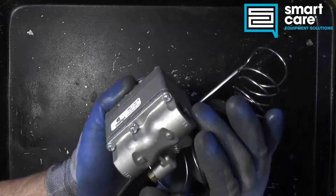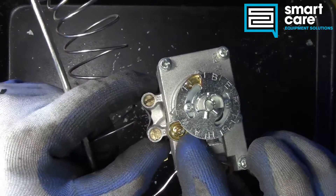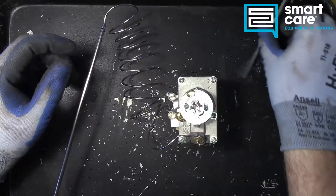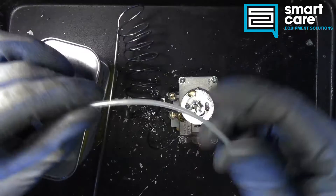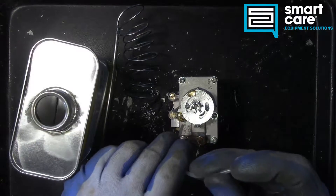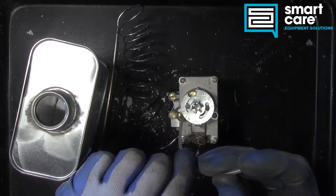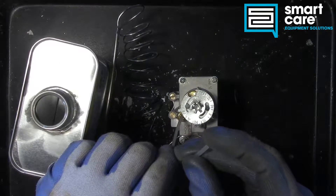The first thing we want to do is get this valve opened up. To do that, they've put some securing compound — some kind of hard compound — over one of the screws. So I'm going to let that soak. I've got some acetone here and a piece of tubing. We're going to use this like a pipette and transfer just a little bit of acetone down into that opening to see if it can soften up that locking compound. We'll let that sit a while and then see if it softens up.